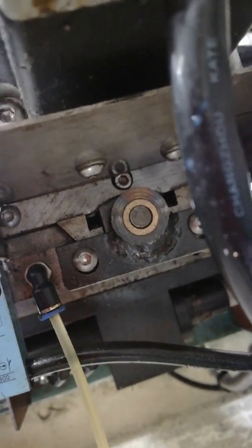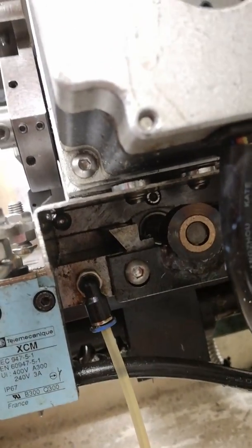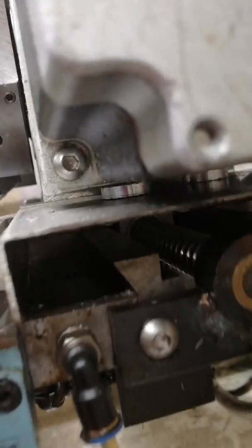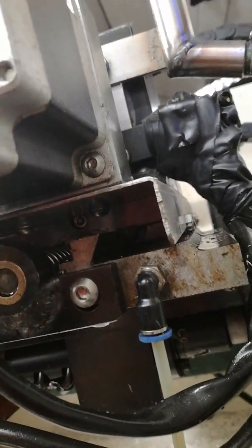As you can see I've also put an outrigger bearing on a bracket for the x-axis lead screw. There you can see the machine fed forward on the MPGs, and in there you can see the much thicker 16mm diameter ball screw and much thicker Vs with the adjustable gib on the non-thrust side.